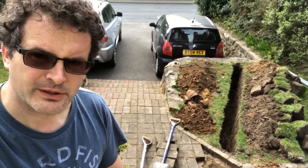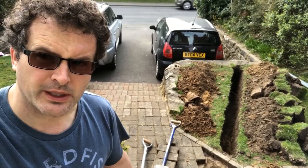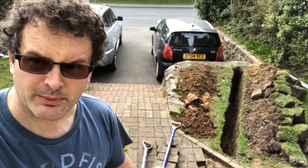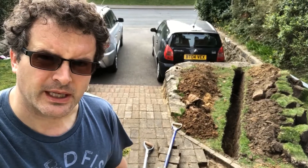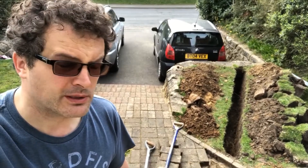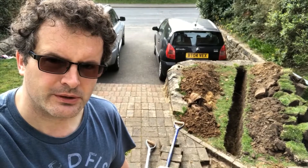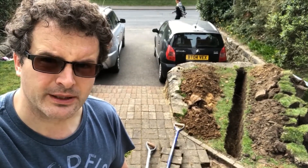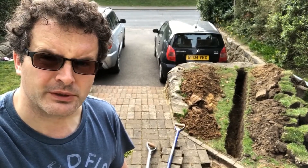Less of a concern under the pavers because the likely excavation is very, very shallow. You would only excavate if you were going to install services, and obviously you'd be looking out for where those services are. Worth pointing out: I did actually find out where all the services are before I started this project. As with all of these projects, the risk is yours, not mine. So check it out before you start — where do they leave the house, where do they terminate in the street? Buy a scanner if you want to find out where they are properly, and paint them on the surface before you start digging.